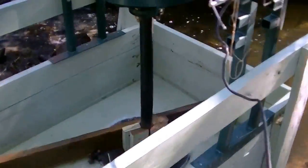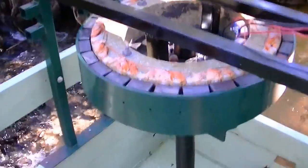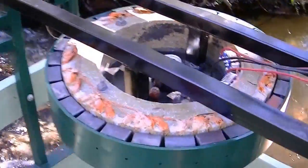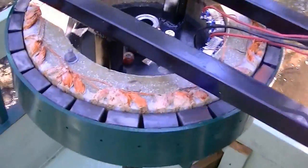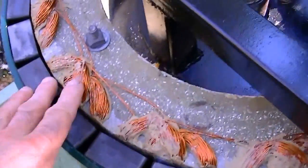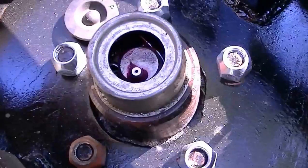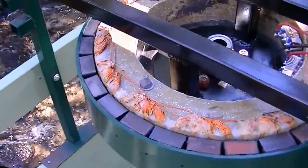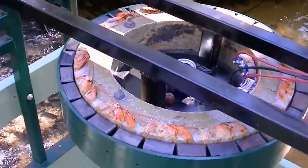I kept a lot of the old parts — reused the magnets. Magnets don't wear out; I have a segment on that shortly. I reused the main hub and put new bearings in it while I was at it, and also went ahead and put a new stator in it. There was absolutely nothing wrong — you can see the zert sitting there going around. There was nothing wrong with my old system other than it kind of looked bad, it wobbled. I've gotten a lot better making generators.